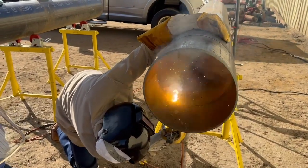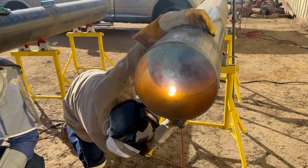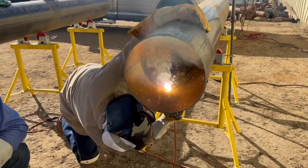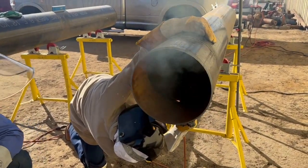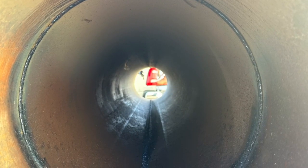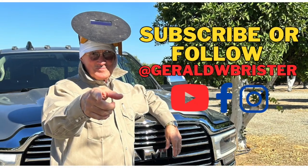You'll notice that I have my legs stretched back — left leg, right knee — with the handle of the pipe having three points of contact. That allows me freedom to weld one-handed. You call that rubbernecking. If you don't have to put a mud board down for every pass and you can learn to weld that way, it will make you faster. And there it is. Thank you.